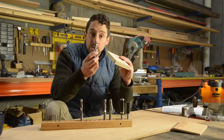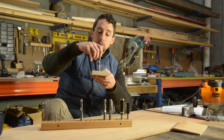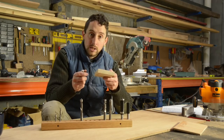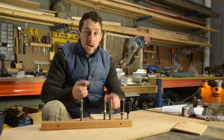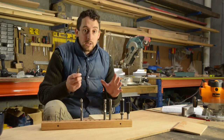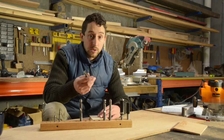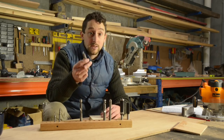Another thing to keep in mind when using these: even though they can give you that really nice clean edge, because rather than pulling the timber into the motor it's actually pushing it away slightly, you want to make sure you have really good guides in place so you're getting the benefits of these bits without it trying to jiggle away and move away from the timber. It's just a matter of working slowly and smoothly to get those really nice clean edges, which you can't really achieve in a lot of cases — especially with something like melamine — with a standard straight bit.